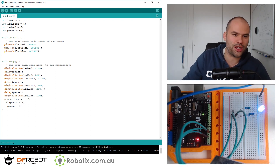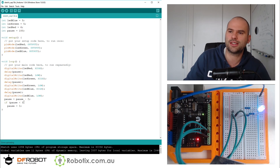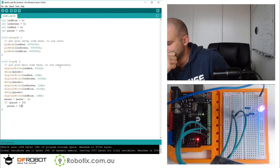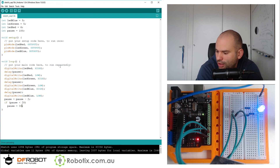We can try to make this the standard frequency. Even if we start at 100, you may still notice it. But I want to make it the standard frequency, which is something like 50 hertz — 50 blinks a second. So 50 blinks a second means that this delay here is 20. We're not going to see all three within 20, so I imagine the magic number is about 8 here, like a pause of 8. But I want to bring the pause down to 20 and see if our eyes can catch this or if we're going to see white. Wow — there you have it. That's 50 hertz. So for a 50th of a second you see blue, then green, then red. And you can see they're making white — they're essentially fooling your eyes.